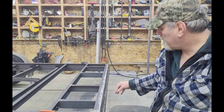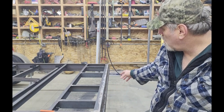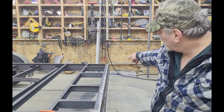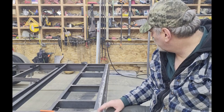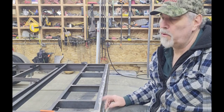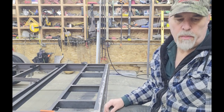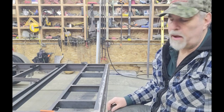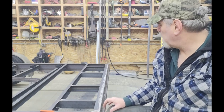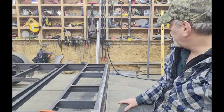There are three hinge pieces on each ramp and four or five matching ones on the trailer, so I don't want to fight a tight one-inch fit through all those holes. I'll clamp them up and run a boring bar through to open them up maybe twenty to thirty thousandths, just to give a little extra freedom and make assembly easier. That's the plan.